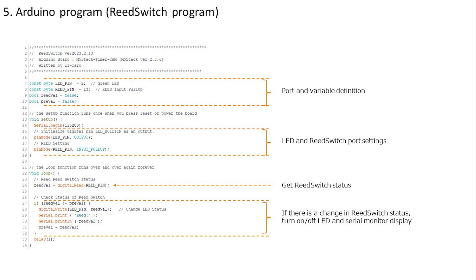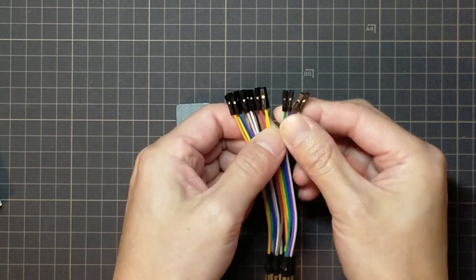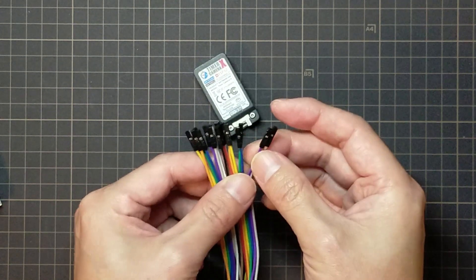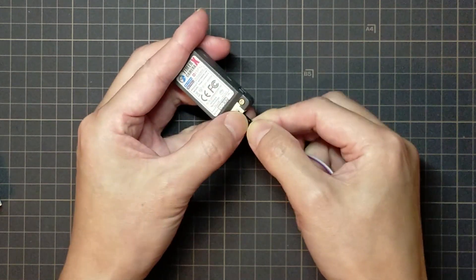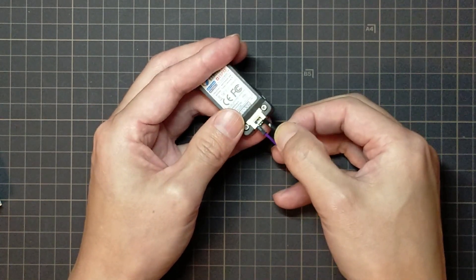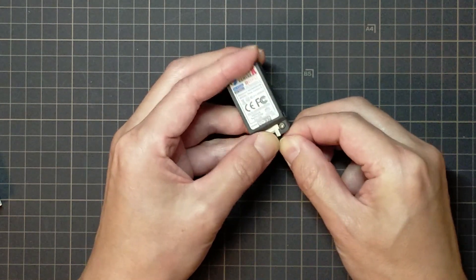We will check the operation, but first we wire the timer camera. For the connection to the HY terminal, since a cable fitting the connector wasn't available, a male-female jumper wire was used. Because four wires do not fit, only two wires are used, wired to ground and IO13. The cable can accommodate up to three terminals; here only two are used, plugged in on both ends.